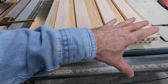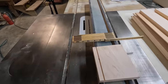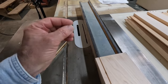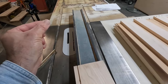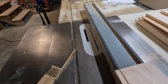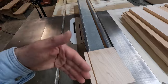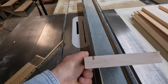With our sides, fronts, and backs all dovetailed, the next step is to cut a dado. You might think you'd set up a dado blade, but the problem with the dado blade is when you use the two outer blades it ends up a little too wide — and the material ends up sloppy in there. I've found over the years the best way is to use a blade that gives you a flat bottom. This one's a rip blade but it's got a nice square tooth that cleans everything up and gives you a pretty flat bottom.